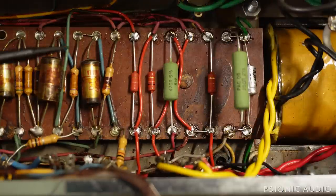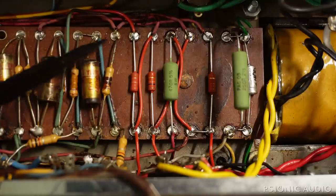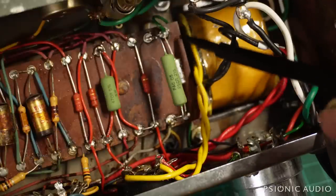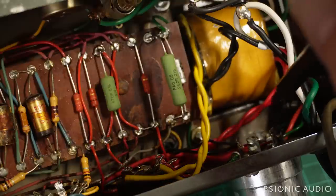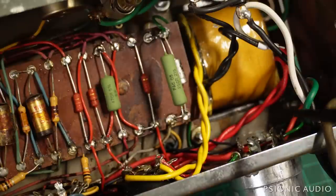Crucially, the preamp and the two filter caps that you saw earlier on the preamp are all grounded to the input jack, but the cathode setup on the output tubes and all the grounds for this multi-section can cap are grounded to chassis over here. This new ground did not require any drilling when I replaced the multi-section can cap.